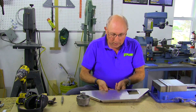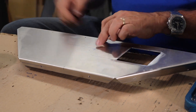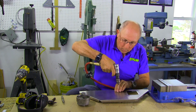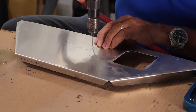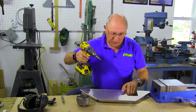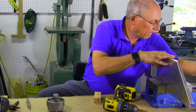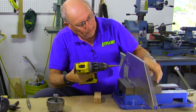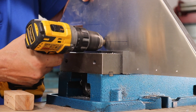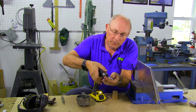So we have our panel, we have marked the center. We are going to punch that, and what we need in that spot is a 5/8 inch hole. We will start with a pilot hole and then use a step drill to get to where we want. There is our pilot hole. Now we will start with a step drill — we're going to put that in our vise to do this, just so things don't walk away on us. That takes us to a 1/2 inch, and we will finish going up to 5/8.